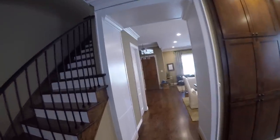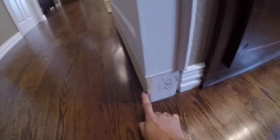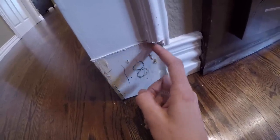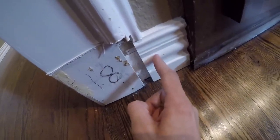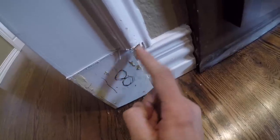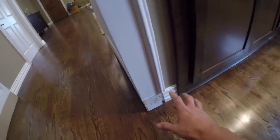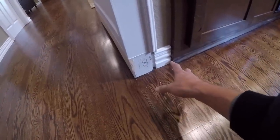The first thing I'll show you is down here — this was a weird transition. They had installed a baseboard on here, but it's been removed because she just had the floors refinished. They tried to notch the panel molding out and have the original baseboard still fit in the mix, which is really strange. There's no way you can get those three moldings coming in to match up. You don't ever want moldings transitioning like that where you can't get them to match.